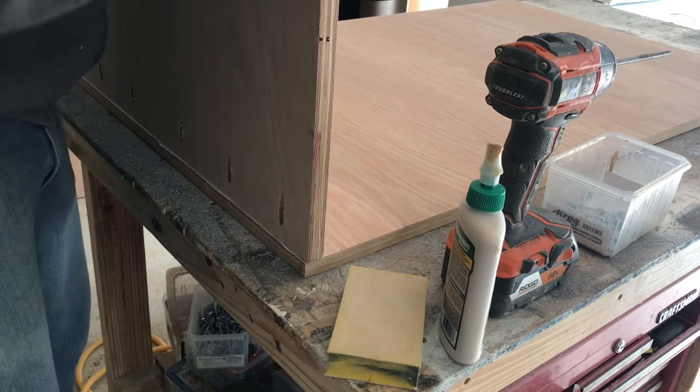You can spend another $50 on an extra sheet of plywood if you want. But once those brackets are on and the thing is stained, and it's in the back, I really don't think you'll ever notice it — you're just going to be sliding those baskets in and out. I want to test fit. I got my basket; this isn't screwed in yet, just sitting in place within about a sixteenth of an inch. You want to make sure those baskets are going to fit. This one does — it's got about an eighth inch gap on each side, which is what I wanted.